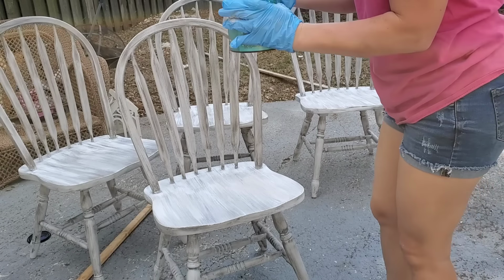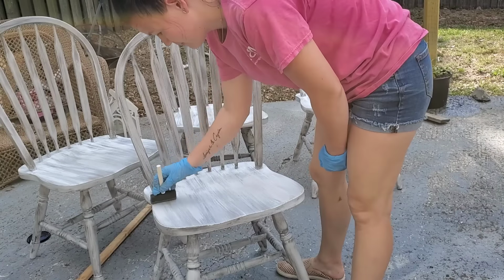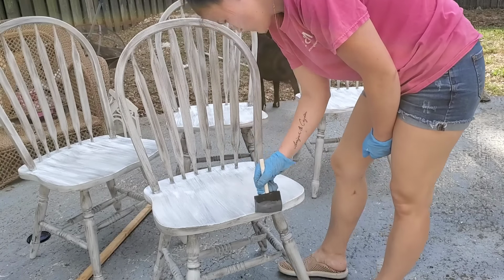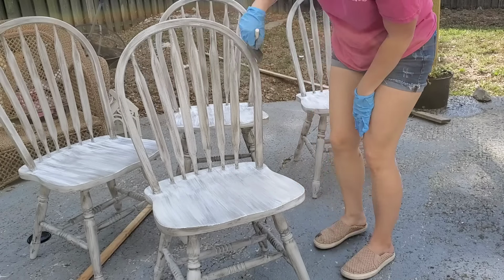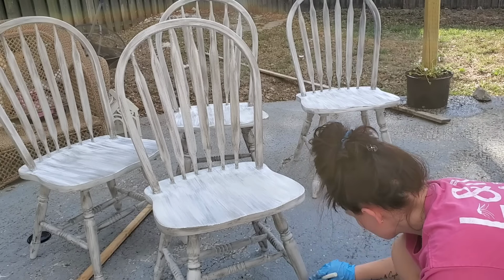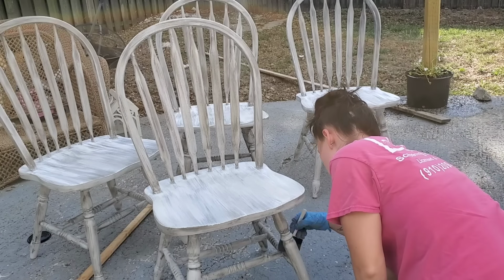Okay, so now I'm going over the chairs and the table using the Minwax polyacrylic in the clear satin finish. I will have everything listed below in the description box in case you missed anything, but I am just using a foam brush to apply this, and to me it's just the easiest way to add the polyacrylic to any surface. It's very smooth and it just goes on seamless, so that's why I like to use it.